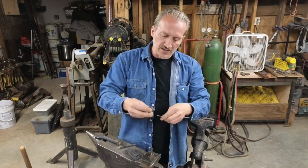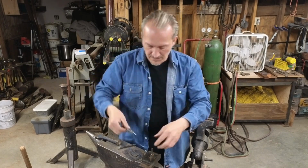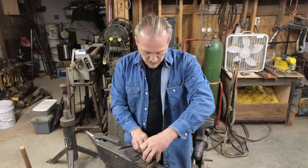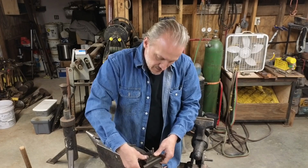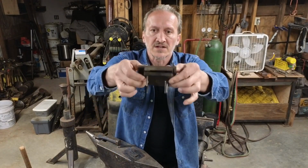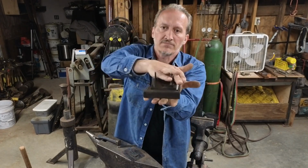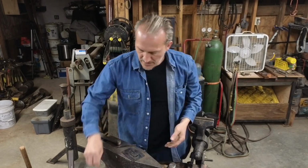So you take your part like this, line up your pin in there, get it set. This would lift up. There's a little hole in the back side to help ensure that the pin is set correctly. You can see it here. And then set into the arbor press, it would just push down, squish it. Knuckles come out nice, clean, pretty every time.